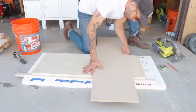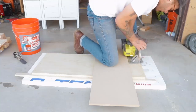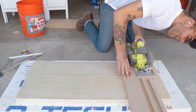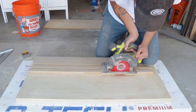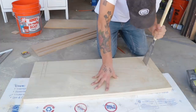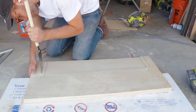After the glue dried, I used my circular saw and a straight edge to trim everything flush. I laid out some lines and used the circular saw to cut out the door where the TV will be lifting out of later. I probably wouldn't have tried this plunge cut if I didn't have the track saw jig — it just kept everything from being able to move and stayed really safe. Then I used the Japanese pull saw to cut the wood in those little corners where the circular saw couldn't get.